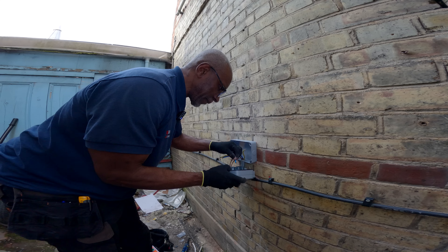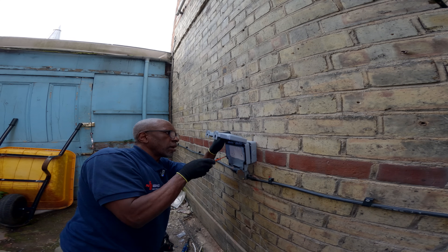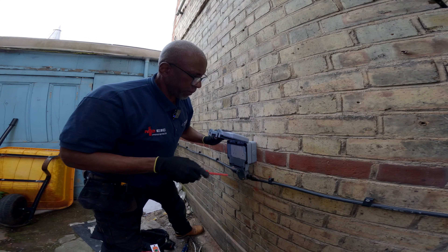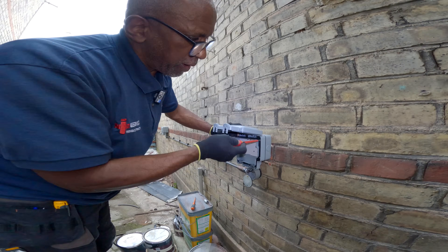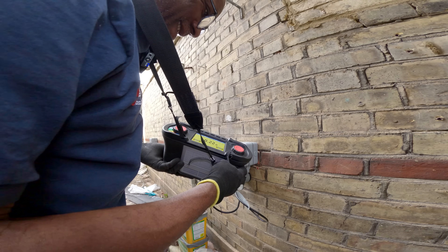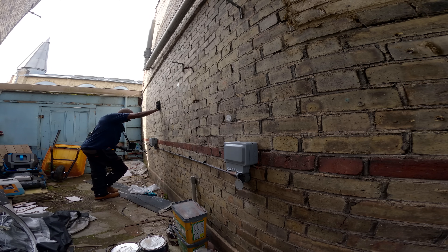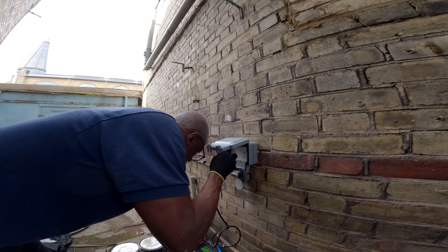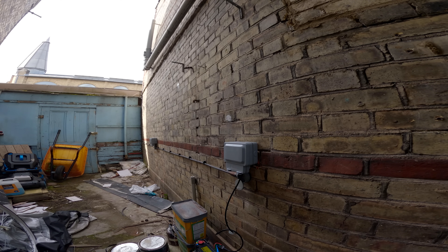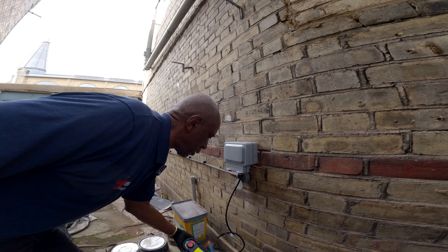Let's do a complete house. Let's do my IR2. 0.22. So I'll go and connect it and come back and do insulation resistance and all that stuff. 0.41, this is 0.43. RCD - see where it trips. Just going to do another test, it's going to turn the power off for a little bit. I'll switch it back on. 30.7 milliseconds.